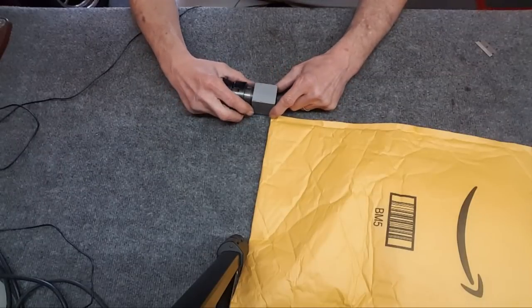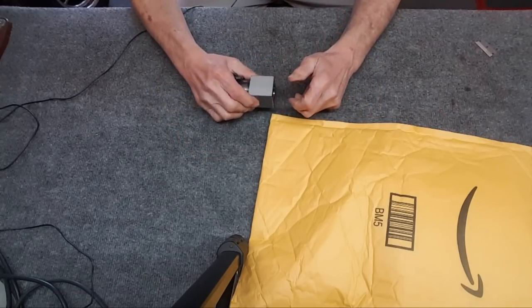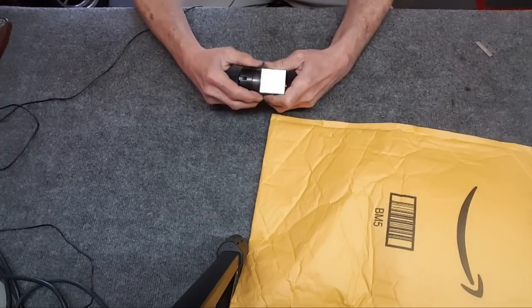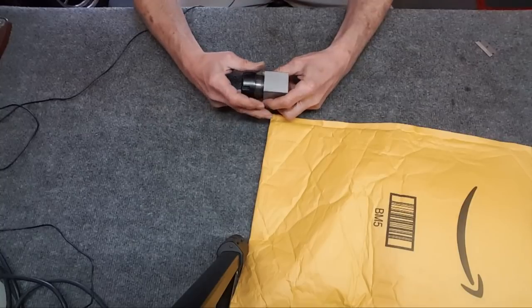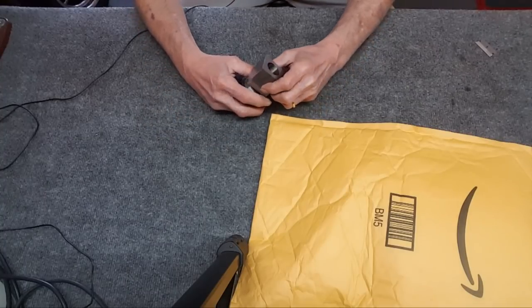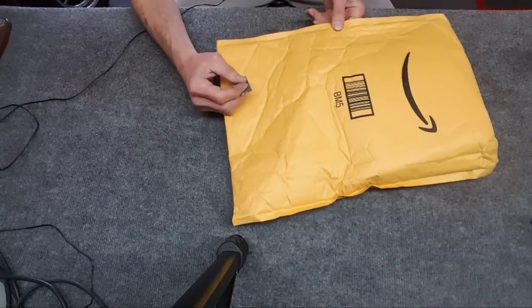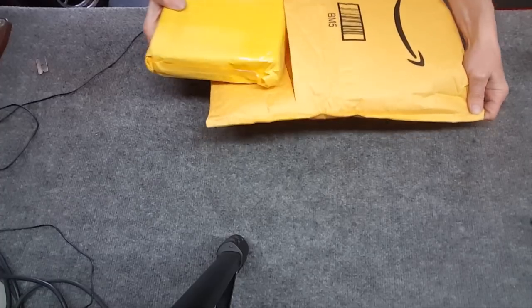In this video I'm going to share another great find - a collet block set. I'll take you over to the bench and show it to you. This style has been great - I bought it a long time ago to hold all the ER-32 collets - but the problem is I don't have the vise here; the outside diameter is bigger than the vise jaw, so you don't have much surface to square it up with and not much clamping force. Since I bought all the 5C collets for the spin indexer, why not get the set? $50, Amazon, free delivery.